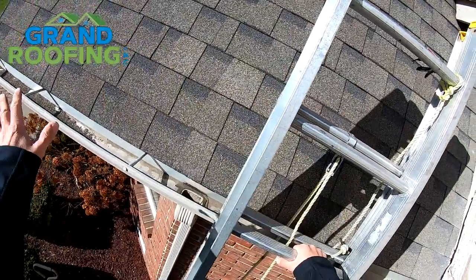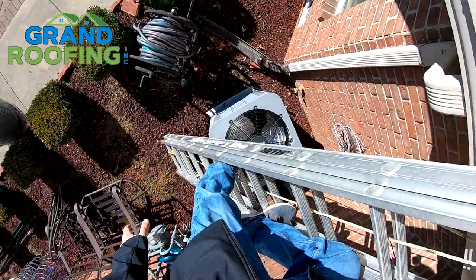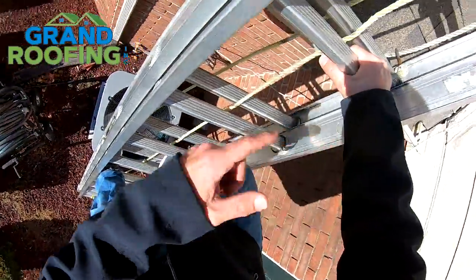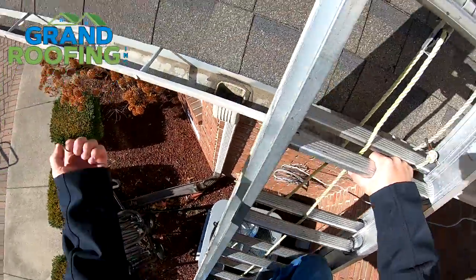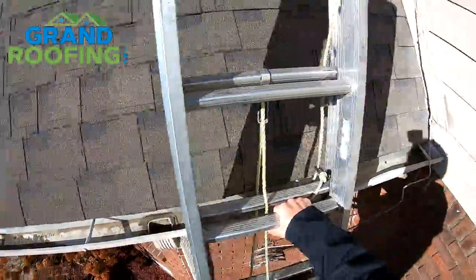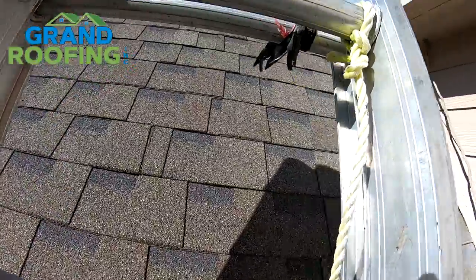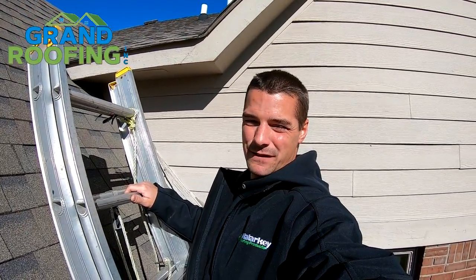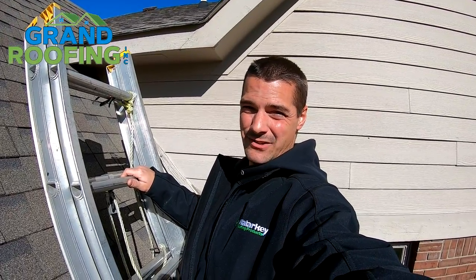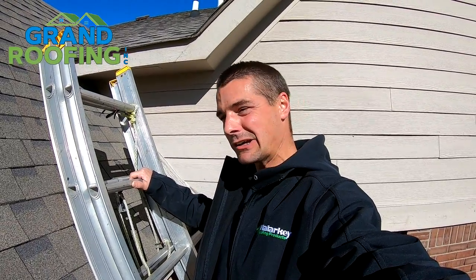That's what this video is about — just a brief overview of rooftop ladder safety. Yes, I have three points of contact; I'm free to move my hand, but I can't climb if I have something in my hand and need to move my foot, because that breaks an OSHA rule. So be safe. Use the ladder safely — it's a very dangerous tool, probably one of the most dangerous tools in the construction trade.